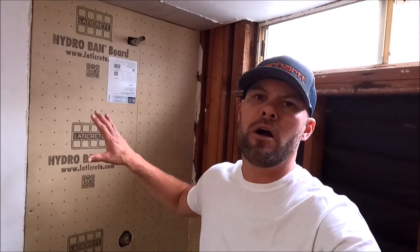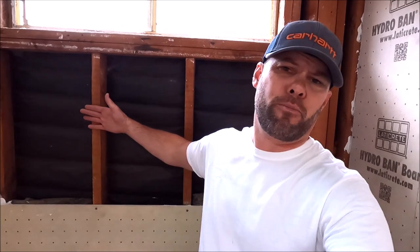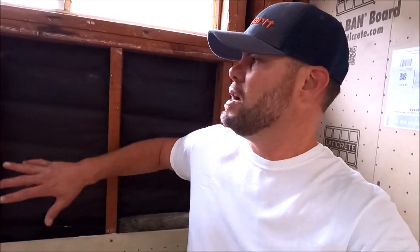It is the next day, so it's time to screw off our boards. The reason I did not install backer board on the upper level is because I want to install my dry pack mortar bed and then pull my measurements so that I have proper niche placement for my tile installation. We'll screw these boards off, install my dry pack, pull measurements, frame the niche, and then wet shim the remainder of this back wall.